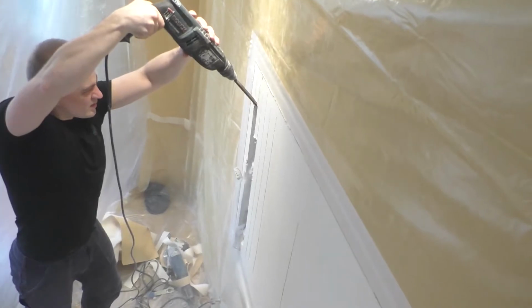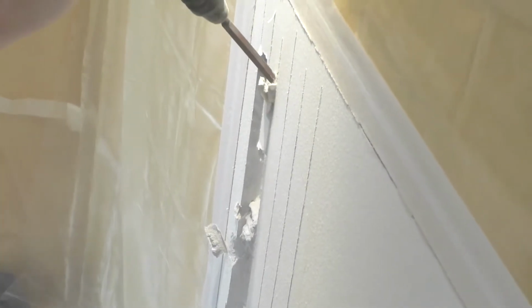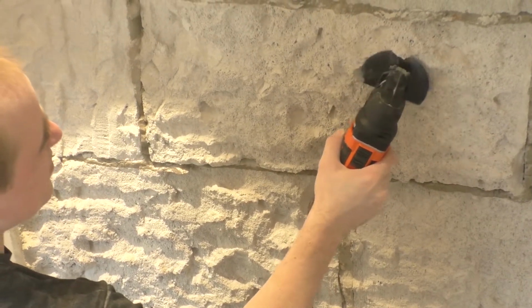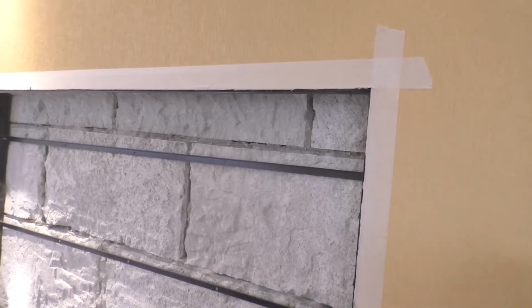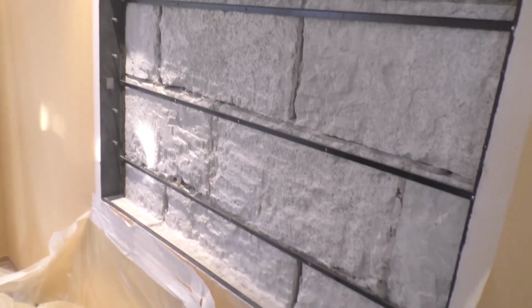We select the depth needed with a puncher. We align the niche using a runner. Now try on the box. If everything is fine and the box is mounted well, meaning it is in the same level with the edge of the wall, you can drill a hole from the switch mounting box.